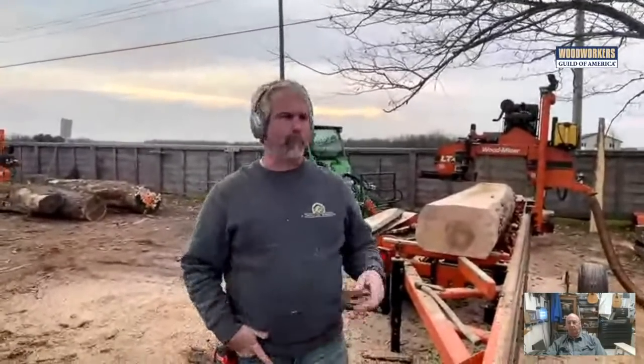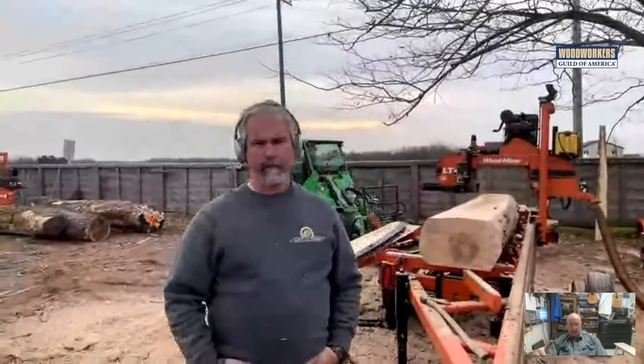We'll be cutting hog boards later on this afternoon. That'll all be five quarter. And then talk us through, so on the mill now, you've made another cut. You want to come down and do another four quarter board. How are you controlling that, where you have to dial that down a perfect inch? Are there stops on the mill? Like, how does that work for uniformity?